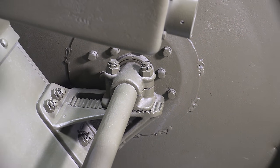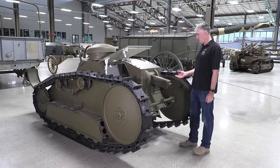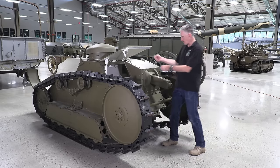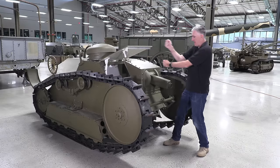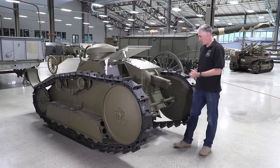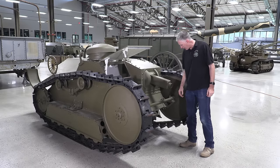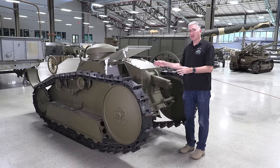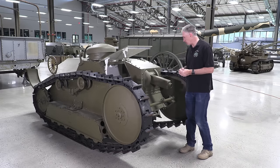The tension isn't going to get any less, but the problem is when you do decide you have to increase the tension — you undo the bolts, it loosens the idler, which is going to immediately spring backwards. All I can think is you've got to have a pry bar or something. Maybe you use the towing loop at the front to leverage it forward again, because there's no cranking mechanism, no wrench or anything else to bring the tension upward. So you're leveraging until you get it to the right position, then bolt down the serrations to mesh again. Fortunately, it's one of the lightest metal tracks ever made on an armored vehicle, so I guess it's not impossible — but it's not what I would like to do.